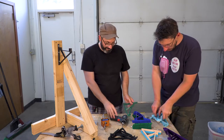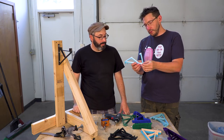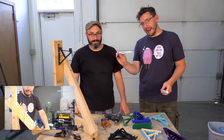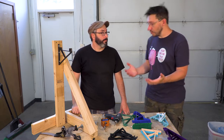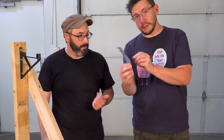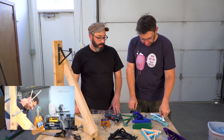We'll move to the HT PLA. It completely shattered. All the PLAs seem to fail pretty drastically, but it did at 64.8 pounds. So HT PLA from Protopasta actually having some structural integrity. Mm-hmm. Let's see, the PETG we handled. This we talked about, which was 40 pounds. The PLA, just standard build series PLA, actually withstood 40 pounds of downward force.